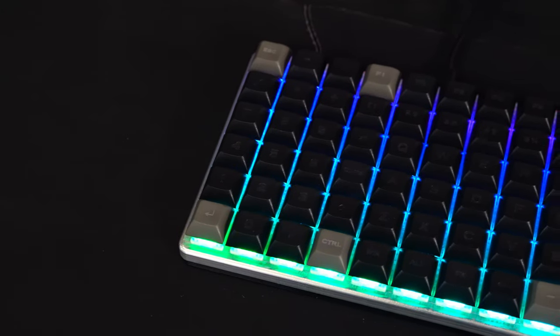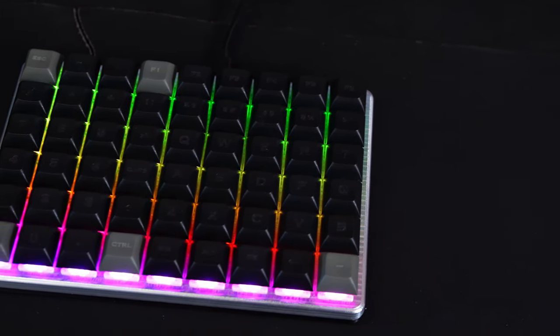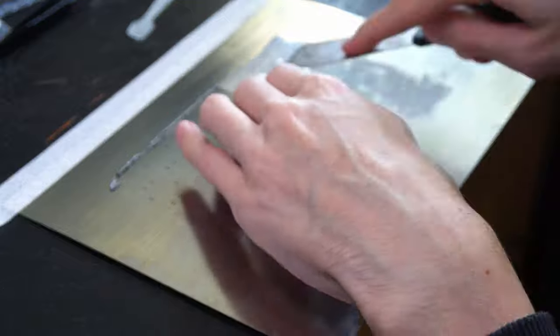The way I fixed it for now is to just not have an LED there and bridge it. Because I don't have see-through keycaps it just provides backlight you can't actually see — since it's one of the middle keys you really can't notice that one is not illuminated. But if I were to use see-through keycaps that would be much more of a shame. There's nothing stopping me from doing a revision of this PCB where I just move the oscillator aside.